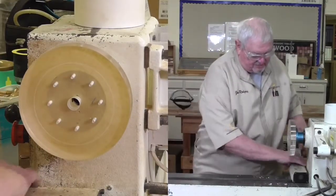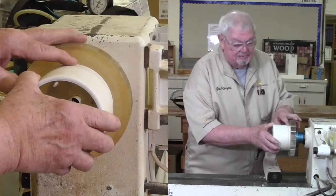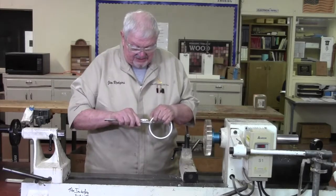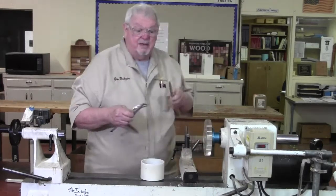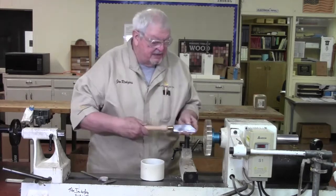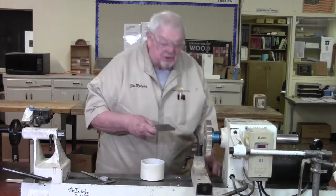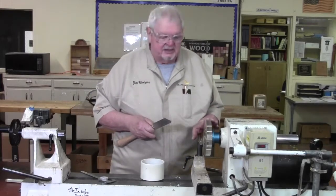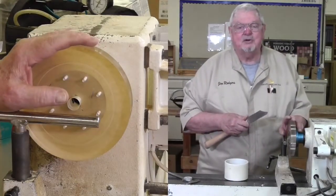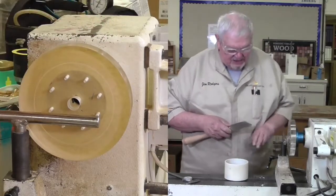My next activity is to come up here and dig a groove that this pipe will drop down into. I laid this out ahead of time to mark the outside diameter. I measured the wall thickness on the pipe and picked up one of my parting tools — my parting tool is about three-fourths of that wall distance, so I'm going to cut in here, move over very slightly, and complete the groove. I want this to fit relatively snugly. I can glue it in with epoxy or CA glue — CA meaning cyanoacrylate.